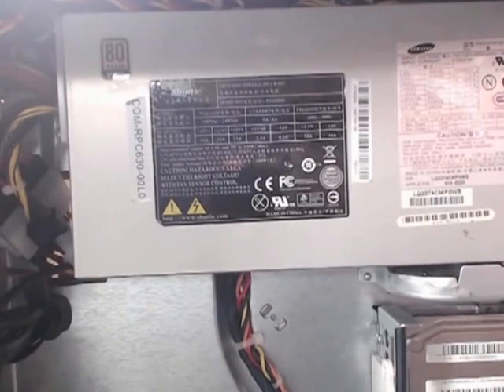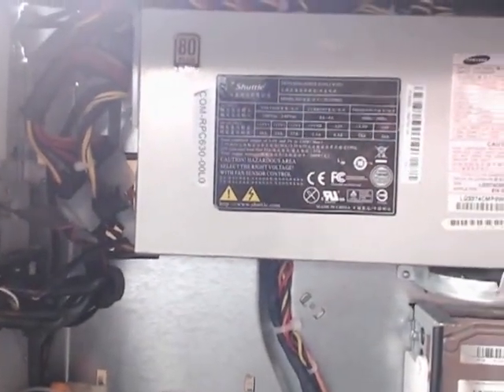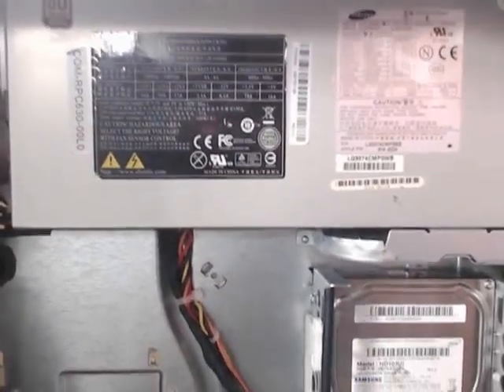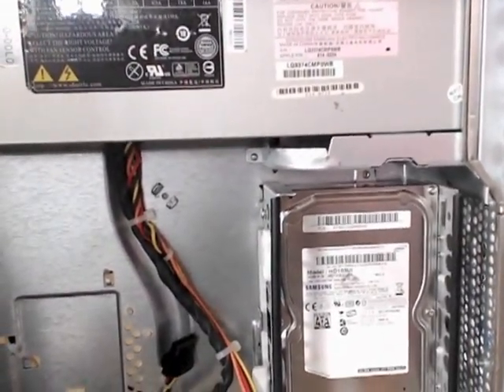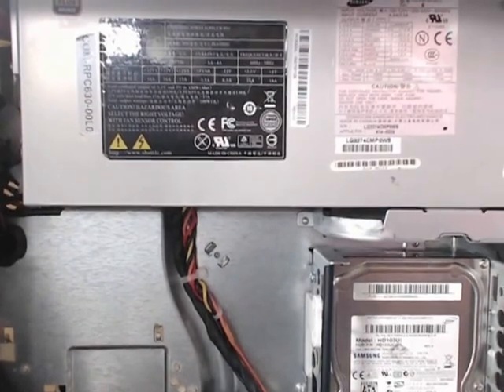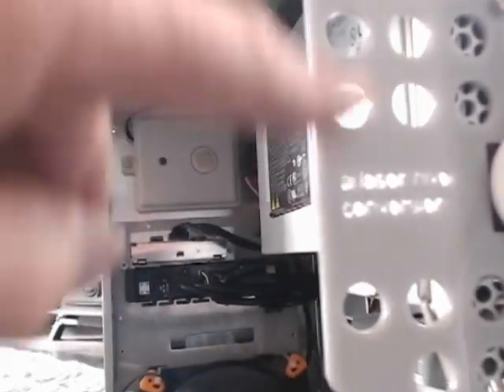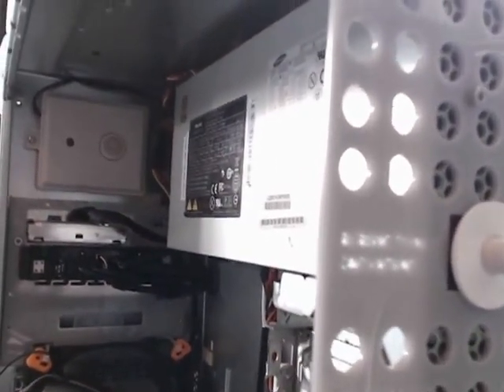What I've done with the power supply is optional — it's the way I chose to do it. I've kept the original mirror drive door housing for the power supply because I really like the way it all fits in there, and inside that I've put a 500-watt shuttle PSU. It's got fans on the intake and exhaust, so it shouldn't get hot. If you don't have the original housing or want something different, you could do a custom rear panel and mount a power supply extending to the side — you could put in virtually a standard ATX supply with some modifications to the mountings.